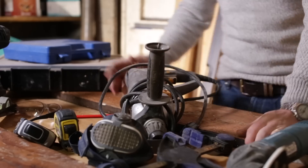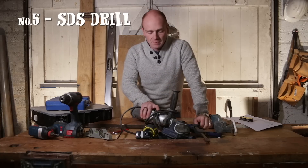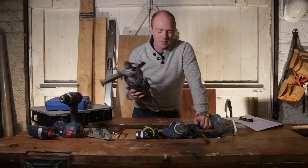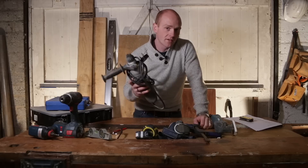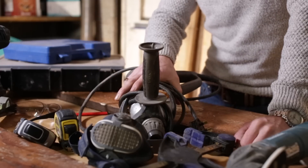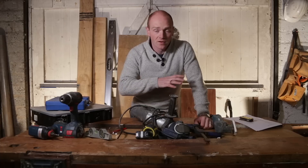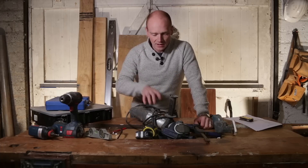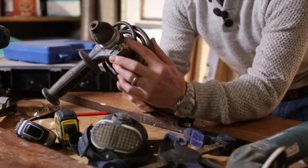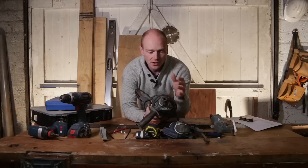Back to power tools. Now this one depends on the house you're renovating. If you're just doing a flat, you might not need it, but if you've got any amount of masonry, you're doing any extensions, demolition work, or fixing down concrete floors, an SDS drill or SDS plus drill is a really good investment. Hiring one is probably not worth it — a store-bought budget one was maybe 60 pounds and I've absolutely thrashed it, whereas I would have spent five times that hiring it. It's an inexpensive tool but one where you get so much bang for your buck. It's super helpful for any amount of drilling and you'll notice the difference between the hammer drill function on a normal drill driver and this within seconds.